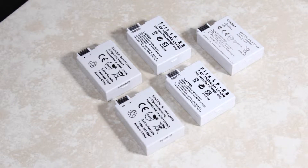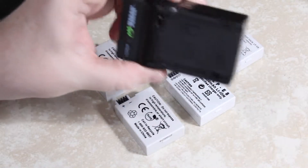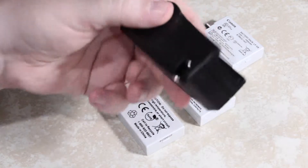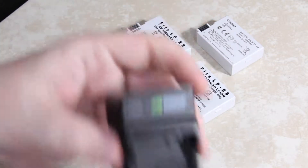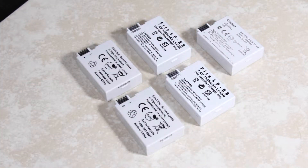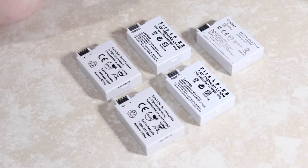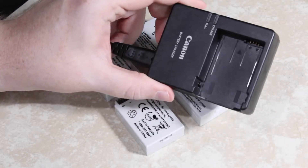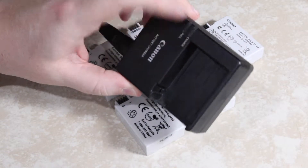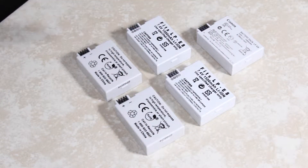What I'm going to do is take a cheap charger that I'm going to take apart and use as a battery holder. I'm going to wire in some charge leads to the ones on here. And then with a somewhat advanced battery charger that has a discharge mode, I'm going to measure the actual capacity of the batteries. All of these batteries were charged earlier today using a genuine Canon charger — I waited until they all turned green on the charge indicator light. Let's get to it.